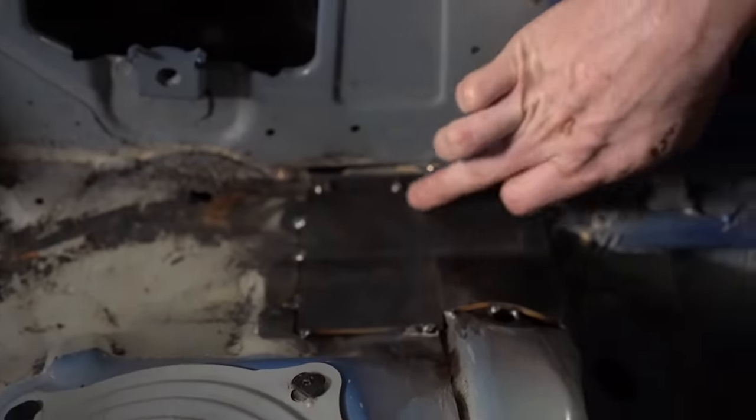The main hoop, I just wanted it underneath this bulkhead of the roof so that I have enough clearance for the backstay to go from this point and cleanly meet up with the tube. We need to remove about a quarter inch off each end. This is not a big deal. You'd be totally fine if you left a full inch on either end so that you can put it in, scribe your line, cut it, and then fit it in so it's perfect. If you make it too short, then you're screwed.